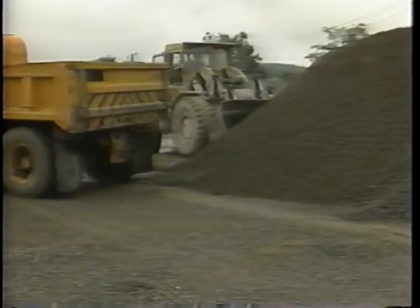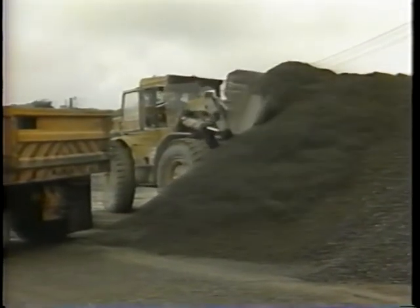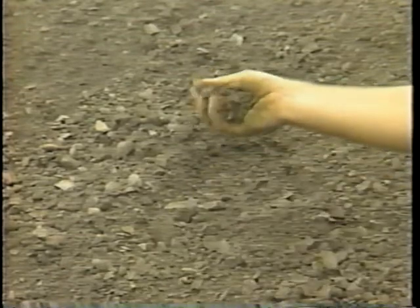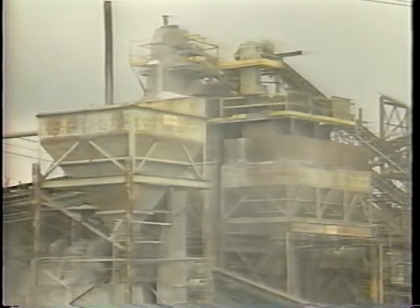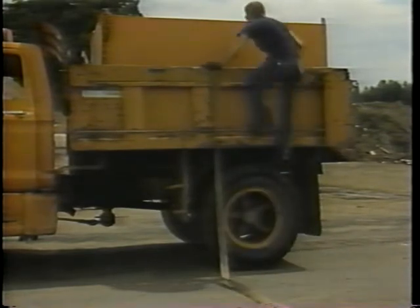You will also need a camber board to check the cross slope, and rakes, shovels, and a wheelbarrow to work the materials and remove large rocks and clay lumps. In addition to the proper equipment, you will need granular material approved by the maintenance engineer. This material includes the correct proportion of coarse and fine particles, well mixed, and can be provided from natural sources or from processing plants. Also, you will need an adequate amount of clean water for good compaction, with the water supply as close as possible to the work site.